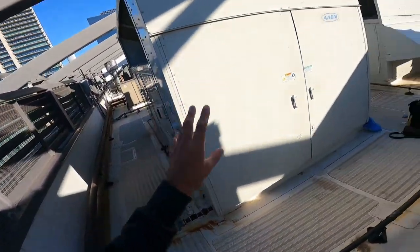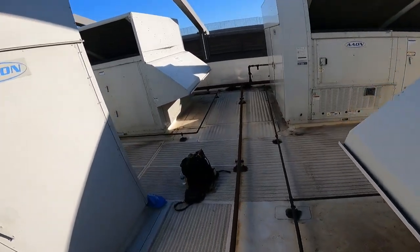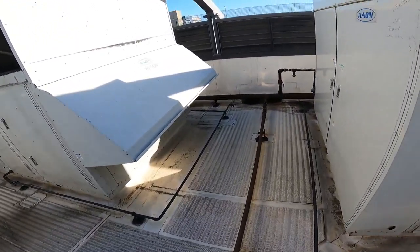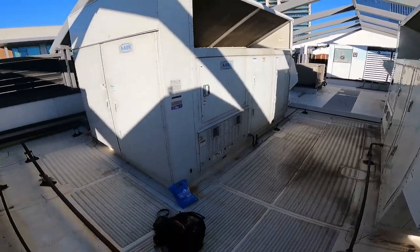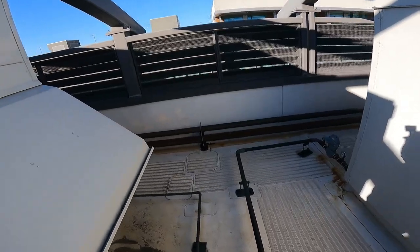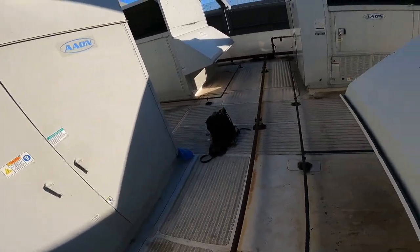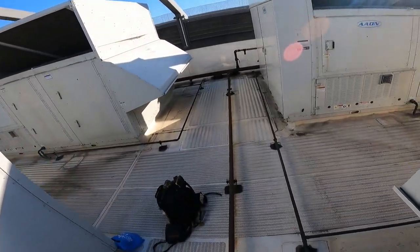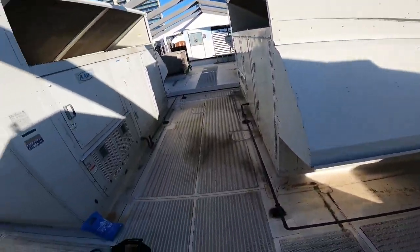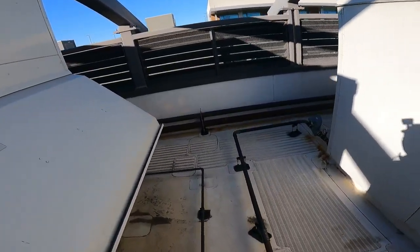This one is gonna take the most time. Basically what I'm getting is an open limit code off of the ignition module. There are two limit switches. It's gonna be the high limit, and then there's gonna be a rollout switch. I checked continuity on both, and they have continuity. So, basically, what I'm going to do is be replacing the control module and both limit switches. That, oddly enough, is the same error code for all three of these. So pretty cut and dry.